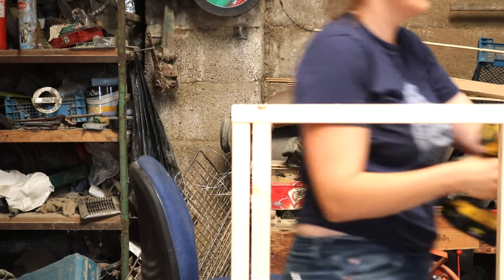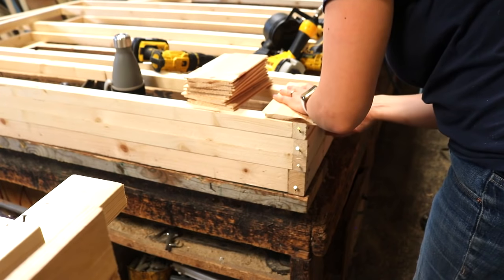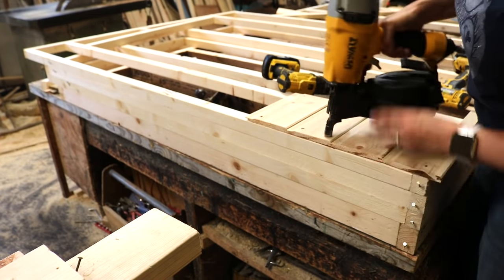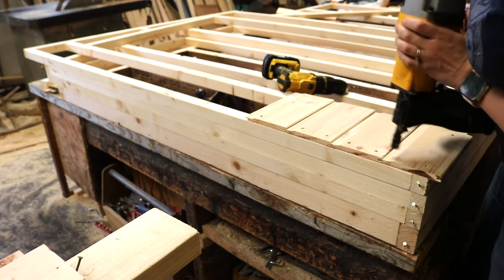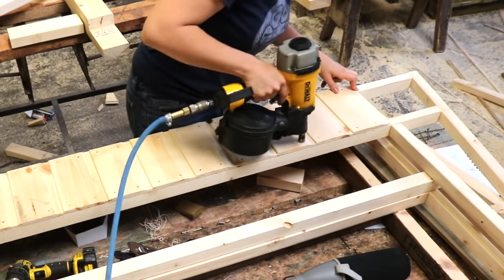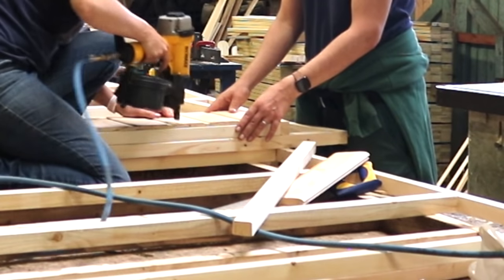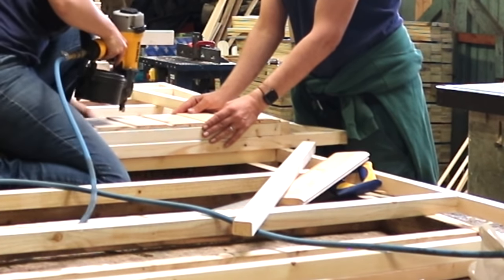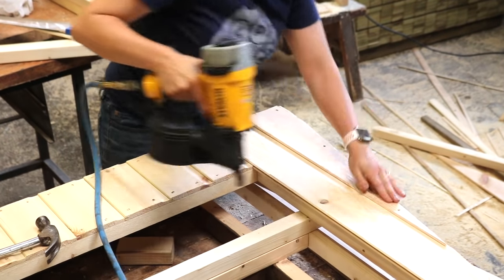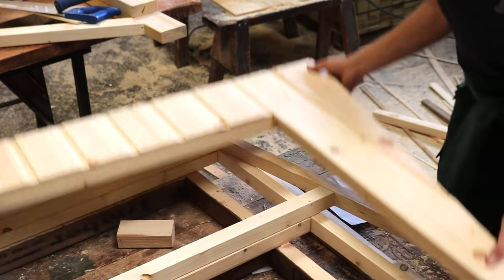Next, it's time to clad with tongue and groove. First, I nail-gunned smaller sections to either side of the door. That first one starts with an overhang and it'll act like a skirting around the base. I was always advised to work in threes as I go, making sure each one is in the groove properly — otherwise it might look odd when you put the other side panels on, or it might not look even around doors and windows. I'd stop just before I got to the top of the door opening, then move on to the opposite side of the door. Once I had symmetry, I could attach a continuous piece along the top, followed by a small angled piece already cut. We then removed the toenailed nails to access the next frame and carry on cladding.